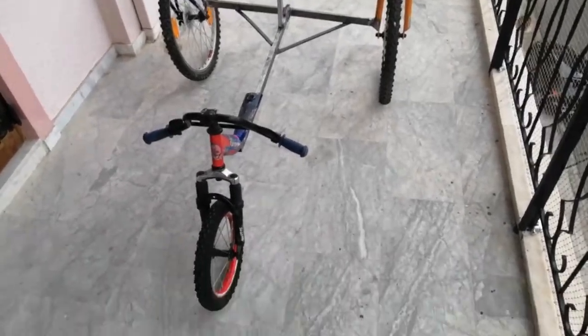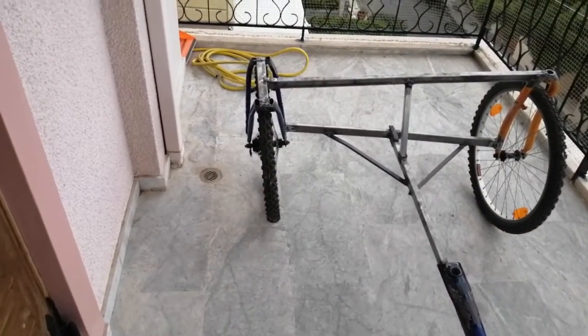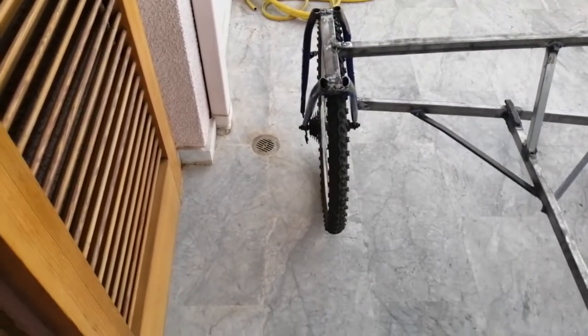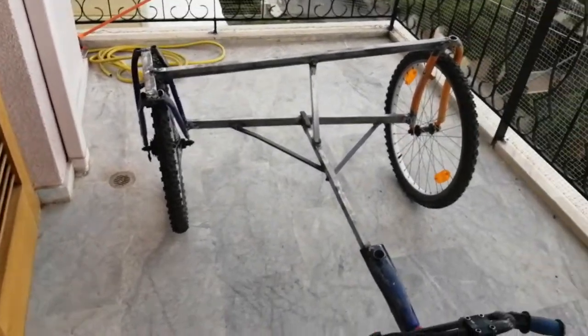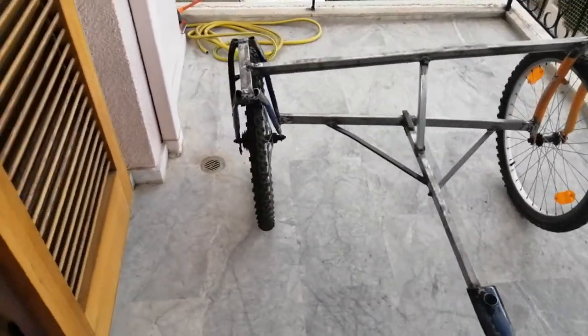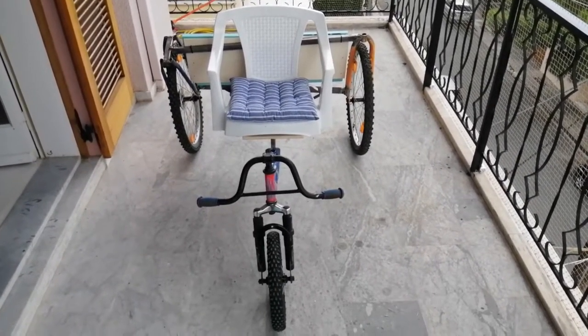Looks a million times better with wheels on. However, Houston, we have a problem. Nice straight wheel, straight wheel pretty much — but that wheel is off at a slight angle. May cut and re-weld, I'm not sure. I got a circular file and filed one side up and the other side down. It was four degrees off vertical; now it's somewhere between one and two degrees off vertical, which I believe is acceptable. It's got a funny looking skew-whiff frame, but it should be perfectly strong. Having a wheel that's one or two degrees off — that's okay.